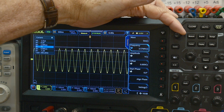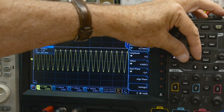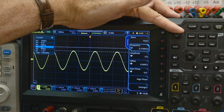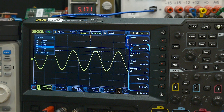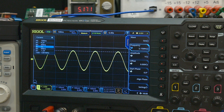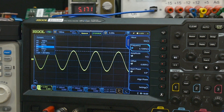So when our frequency goes up, we go down in amplitude, and when we get to that other line — which is happening right about there — we're right at 5 megahertz. So this is a 50 megahertz gain-bandwidth product part, because we have a gain of 10 and measured 5 megahertz bandwidth. Wow, these guys are screamers!